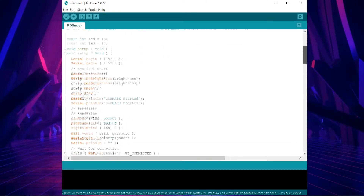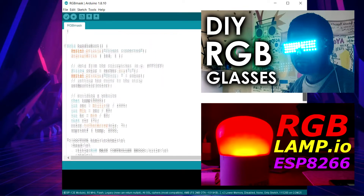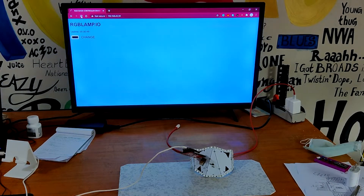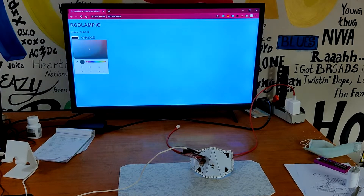The main code is a web server sketch that I use for a few of my similar projects. This web server has a color palette — we can select any color from it and the ESP12F will trigger that color in the WS2812B LED array.